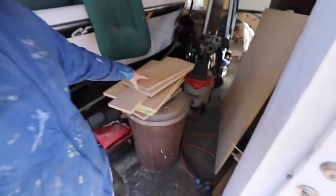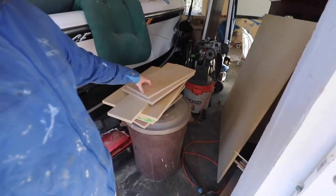After getting all my drawer boxes built and installed last week, it is now time to work on drawer faces. I picked up another sheet of MDF, which will match the stuff that I put on my cabinet doors. I've cut a whole bunch of squares and rectangles that fit the sizes of all my drawers. I'm going to do a quick sand on them, then set up a little painting station outside and start painting the edges and backs. Then I'll get the sprayer out and do a nice coat on the face and edges to get them looking real crisp.